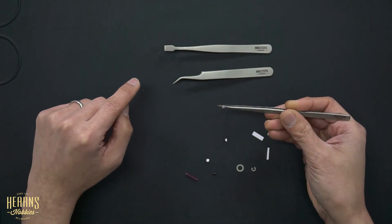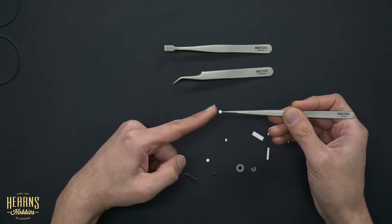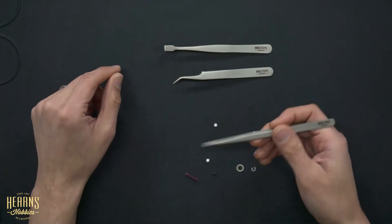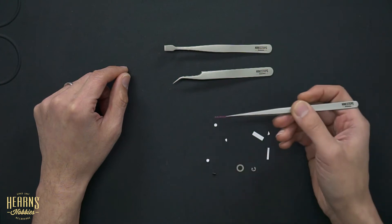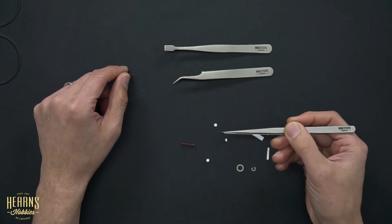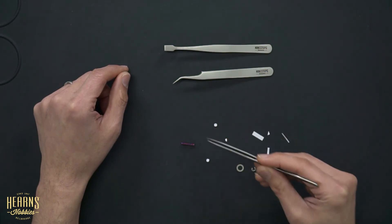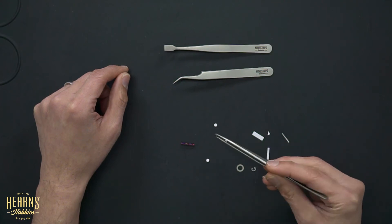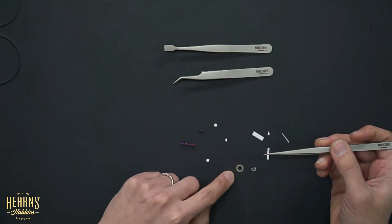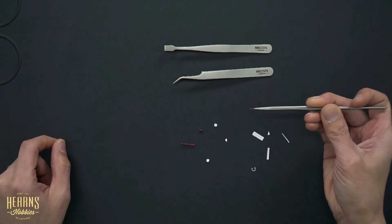That wider grip is more secure on a flat piece. Holding from the tip, the part moves quite easily and can flick out if you're not careful. The same applies when picking up other items — like a small metal collet that's pretty round. You have to be careful not to squeeze too hard or it'll go flying. But tweezers make a huge difference because with your fingers you wouldn't be able to control that placement. The really thin shim is so thin I can barely move it with fingers, but with tweezers it's easy to pick up.